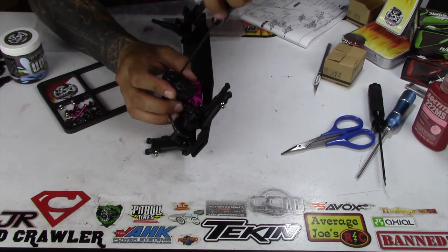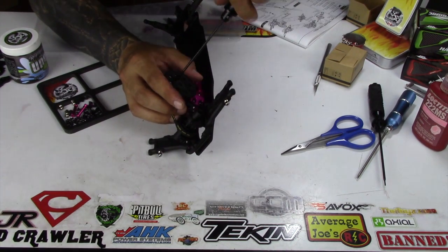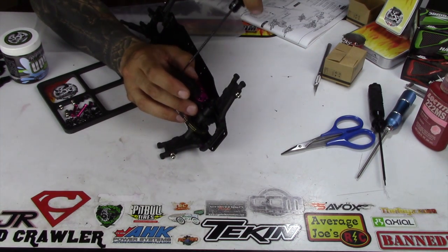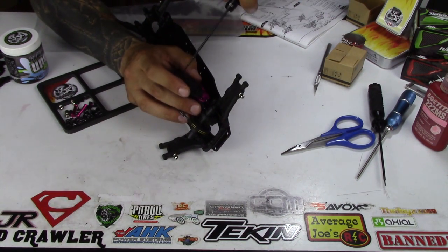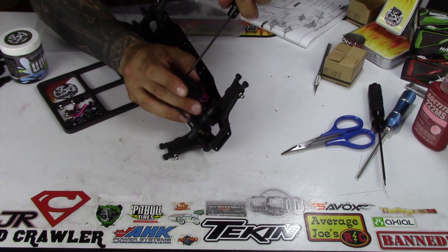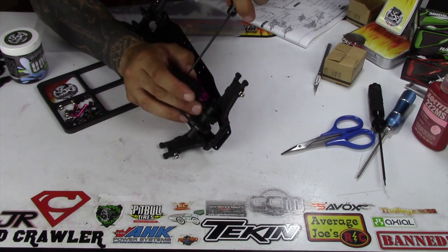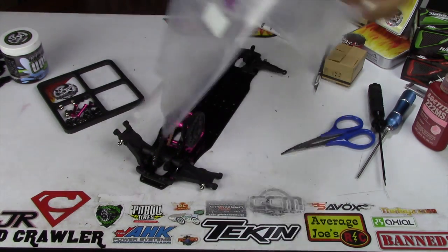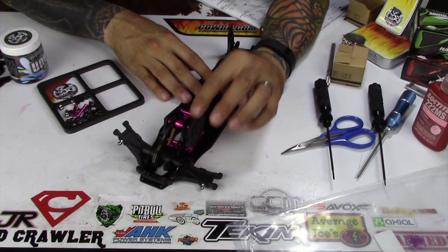So we just evenly crank them down. It is into metal on the back side, so if you crank this thing down tight enough, you will squish the snot out of this plastic. So it just has to be hand snug evenly through the 4 of them. Remember, you put Loctite on this, so within the 24 hours, it's going to lock it down so it stays there. Now you'll see here, everything turns freely.